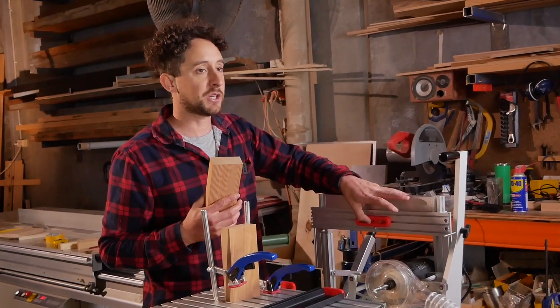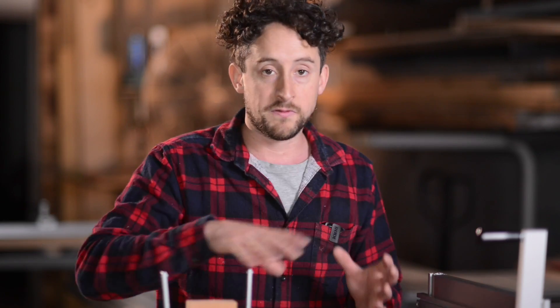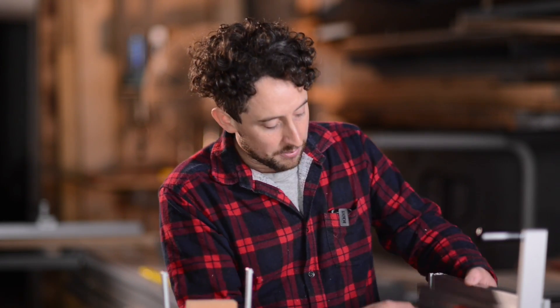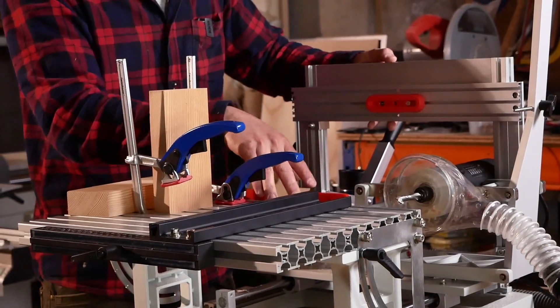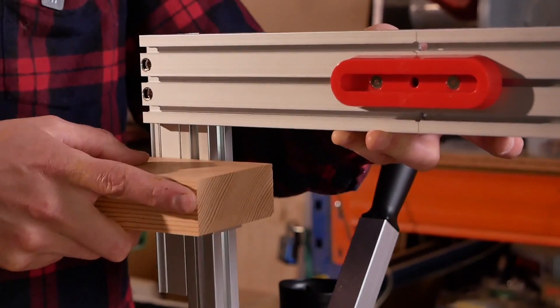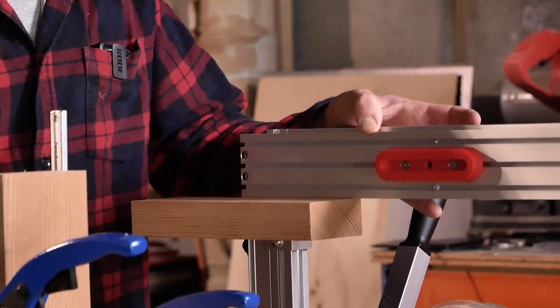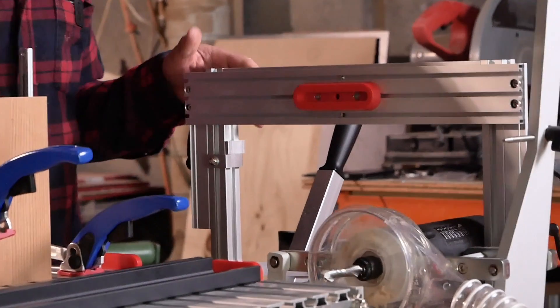This makes sure your joinery lines up with what is on the table. I have my center line marked on the table referencing this center point up here. Once those screws are done up you can take this out and use it later. The next thing is to make sure the template holder is set at the correct height. You need to have already gone through the setup process, which places a little stop so that your router bit references the actual height of your bench.